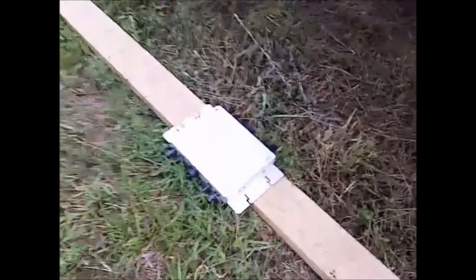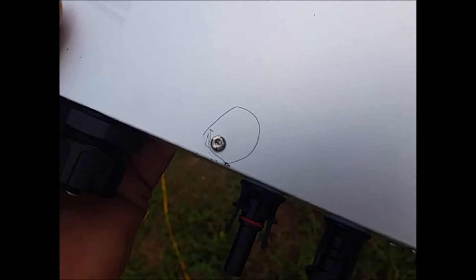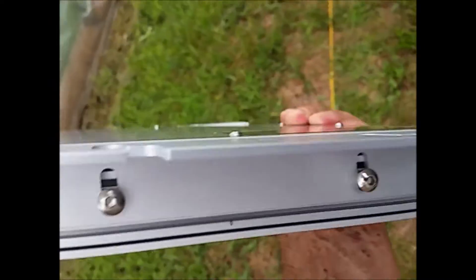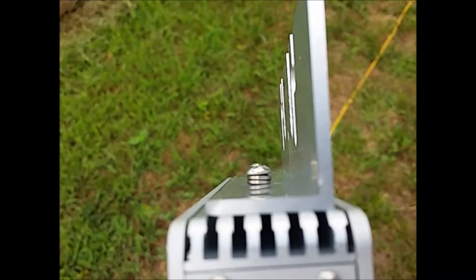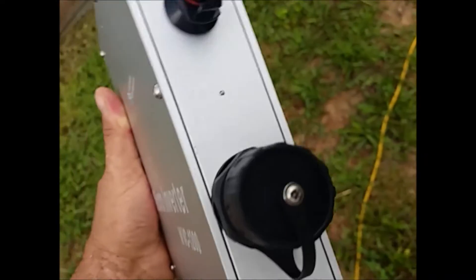They're a little bit fragile. The connectors break off fairly easily. This screw with the circle around it had actually fallen off the inverter and was in the packing crate when I opened the box. The screws on the end that hold the angle brackets — I had to reverse my brackets, which were originally 180 degrees rotated. When you tighten these screws back in you'll strip them right out; they're drilled into the cooling fin and there's not much material for them to grip.